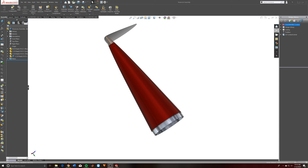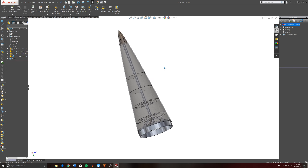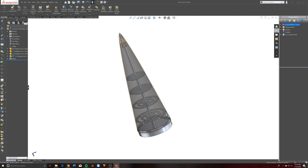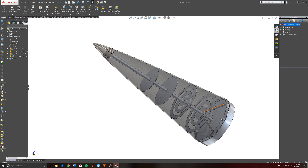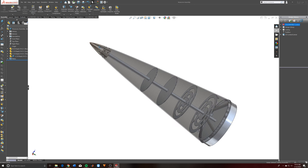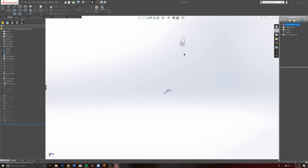Some of the other major changes: the nose cone is now made of multiple parts, as you can see here. This is very rough — it literally took me two hours to put together — so I'm just showing you the general principles on how to do something like this. We'll make something more in-depth over the course of the semester as we get closer to the CDR. It's broken down into four major pieces. You've got the nose cone tip up here, which is essentially just a stainless steel bullet that we're going to mount the carbon fiber shell of the nose cone to.